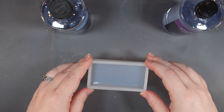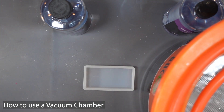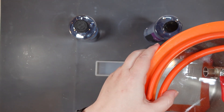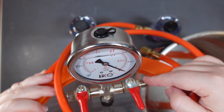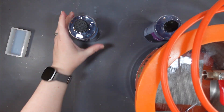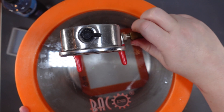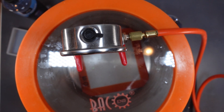I'm going to bring out my vacuum chamber. If you're not familiar with how a vacuum chamber works: you have a vacuum pump, and on the lid you have a valve — one port is where air is pumped out by the pump, one is where air gets let back in when you're done, and there's a gauge to tell you how much pressure you have.